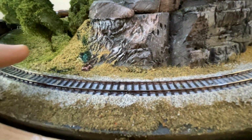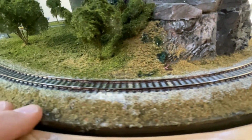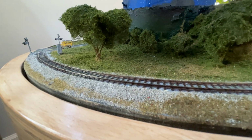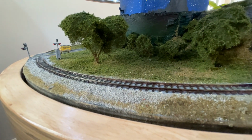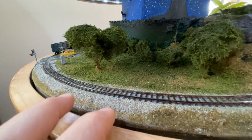Okay, so this rail right here is attached to a wire that goes to a base of a NPN transistor. So that train is acting like a current limiting resistor. So when the train travels over that gap, it provides current to that transistor, turns it on, and then the transistor turns on a relay. And that relay provides the power to the circuit I showed earlier in the video.